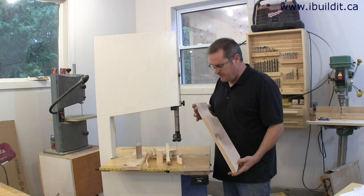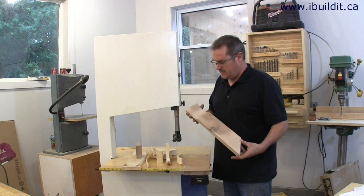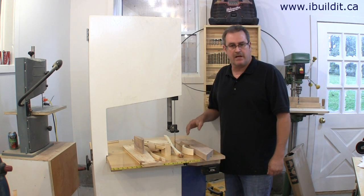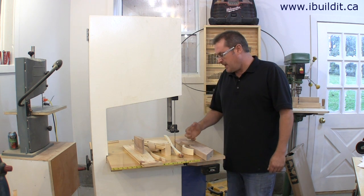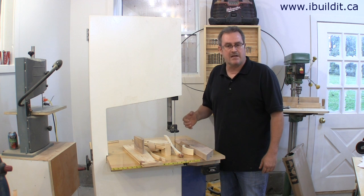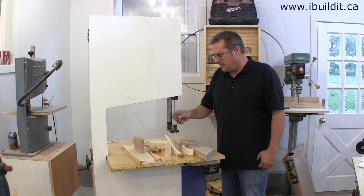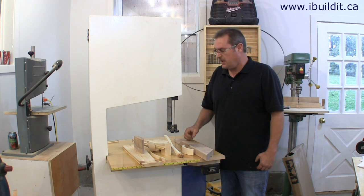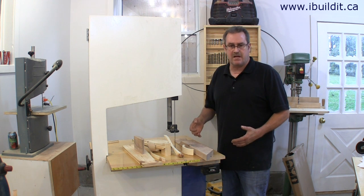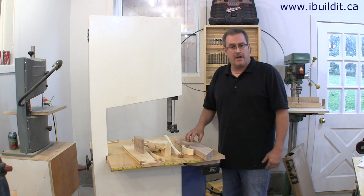Not bad — this is three and a half inches of maple and it cuts through that no problem. That's the quality of a good blade, but the blade guides didn't allow the blade to wander either — they held it firmly in place. A lot of the cheaper bandsaws come with steel blade guides and I guess that's the reason why they have a bad reputation. In fact there's absolutely nothing wrong with steel blade guides, especially if they're well hardened. The steel-on-steel contact is really low friction and there will be no heat buildup — that's another myth going around. The blade doesn't even get warm, the guides don't get warm either. I'll be the first to admit that I just did this not too long ago, and time really tells the tale on these things, but I don't see a problem now and I probably won't see a problem in the near future. Anyway, that's it — thanks for watching.